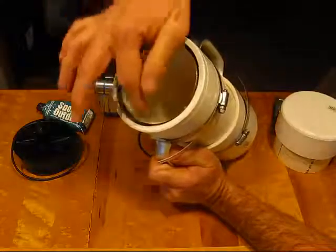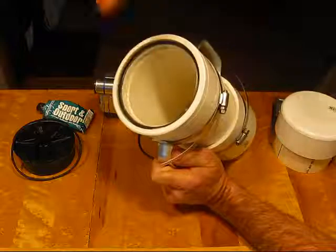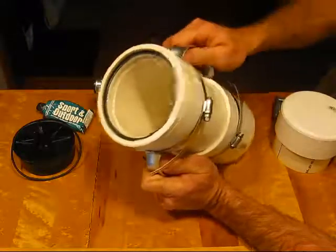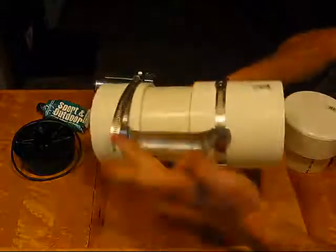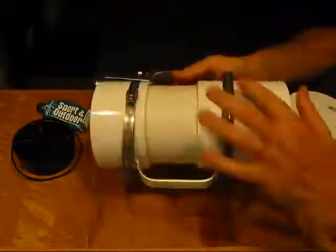You've got to do this real quick. Put a little layer of more silicone, then put your quarter-inch piece of Lexan in. Put some weight on it, let it cure up overnight. Once the lens is installed, put some handles on it — just some handles — a couple of 4-inch hose clamps. I'm going to trim the excess off.